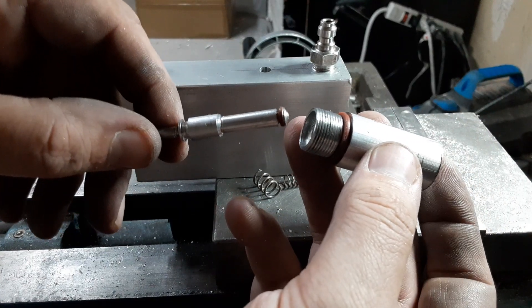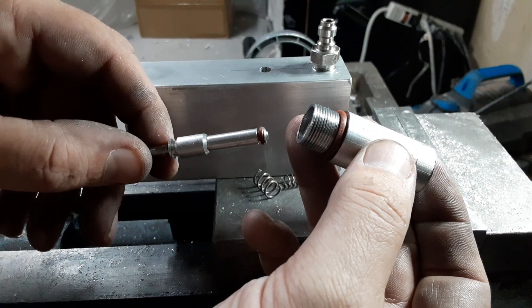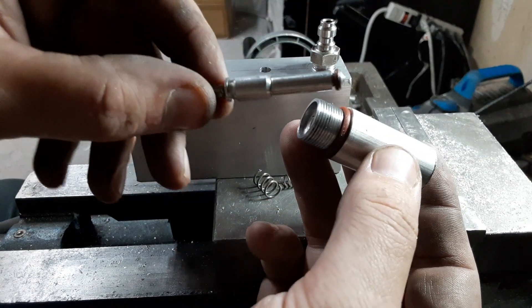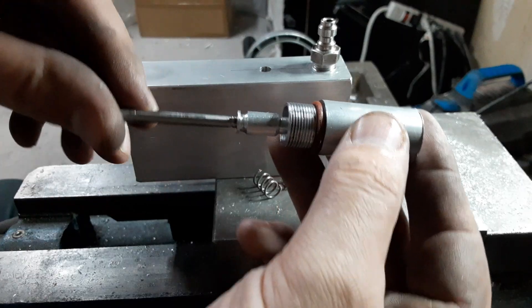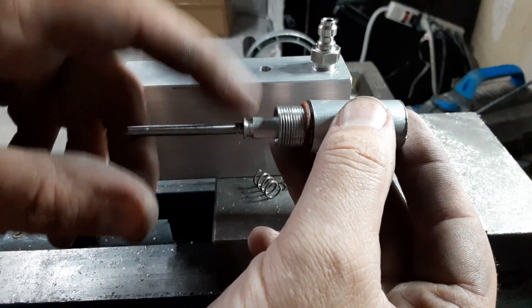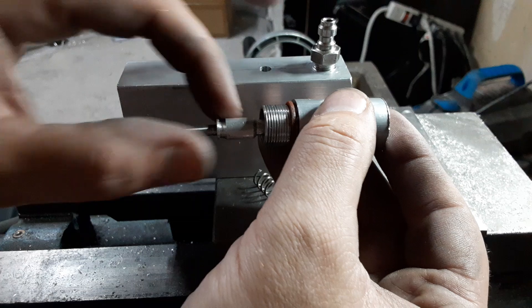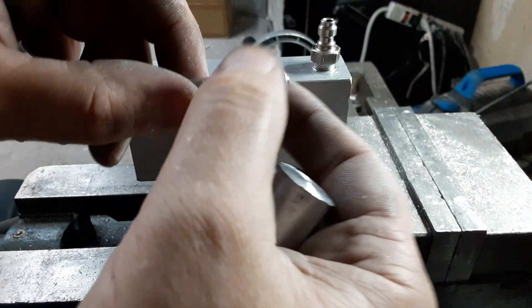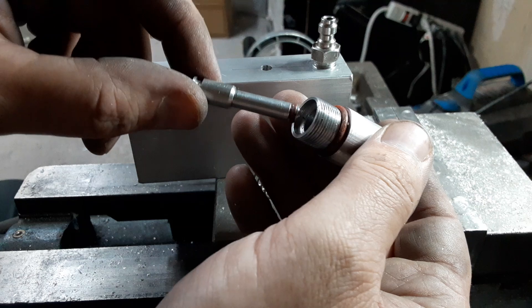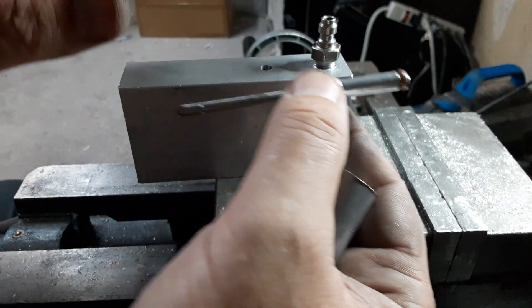I've done builds with these before — like I had a big balanced valve in the nine millimeter pistol. The spool valves with all those gadgets I made and the .50 cal pistol, those are all technically balanced valves but often referred to as spool valves. There's an o-ring on the front of the poppet and that goes into this balance chamber, and as you can see, it's sealed. The pressure is generally calculated by radius times radius times pi times the pressure, and that's your seating force on the poppet. In this situation, that seating force is also applied in the forward fashion on this o-ring, so with this being a quarter inch, it'd be 0.125 × 0.125 × π × pressure. That offsets the seating force — ying and yang — it's being pulled off the seat even before the hammer strikes it.